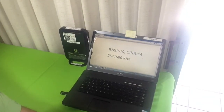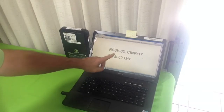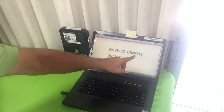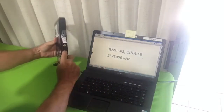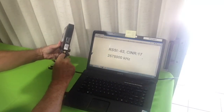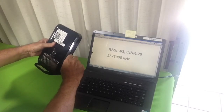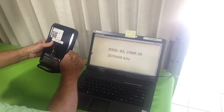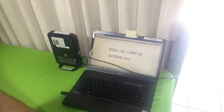The Hub Express is currently showing an RSSI of negative 62 and a SINR of 18. Now if I flip this switch to enable and connect up the external antenna, you'll see that the RSSI has now gone up to negative 43 and the SINR is at 22.